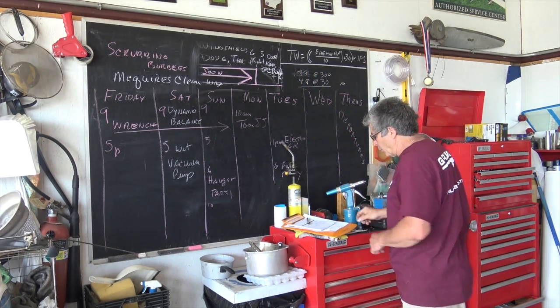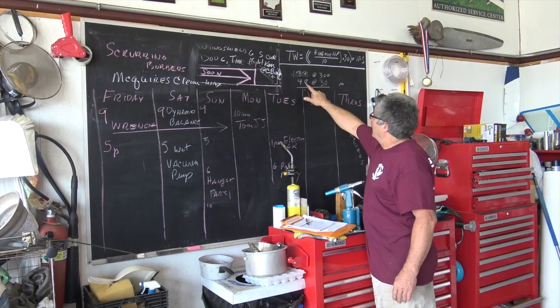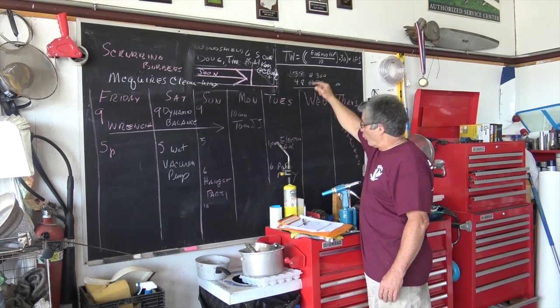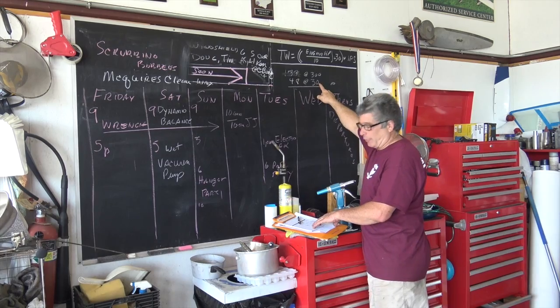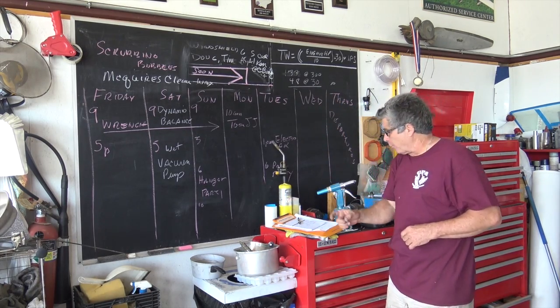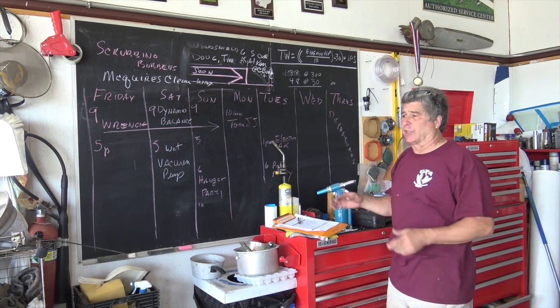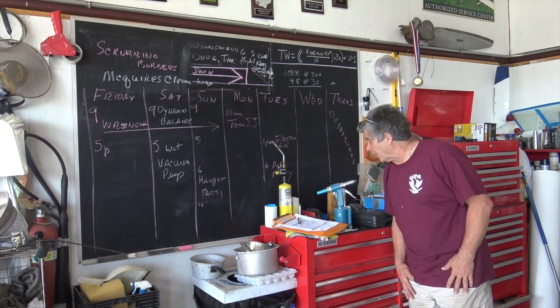So what we did was we ran the calculation. If we were putting this at a 1 foot radius, it'd be 4.8 grams based on the formula. So we're going to put approximately 10 grams at 30 degrees, and 10 grams should just be the bolt and the nut. We're going to go over and weigh up something small, put it on there, and then this final one should have us fairly well down below 0.07. So let's go get the weights now.